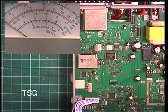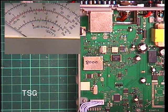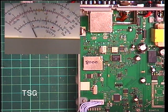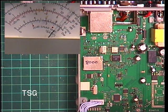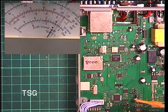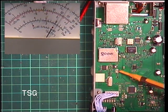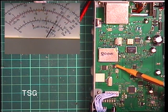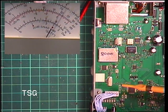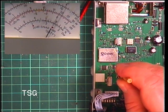I'll turn down the volume and we'll start. We'll go on to the 3-watt range on the test meter, so full scale deflection is three watts. It's coming out of the factory doing two and a half. So one of these adjustments is going to be a power regulator. I can see there is a relatively big power transistor, surface mount. Educated guess — that's going to be power. Let's see what happens. I'm wrong there.